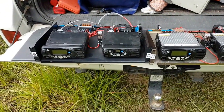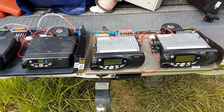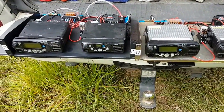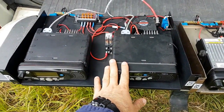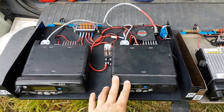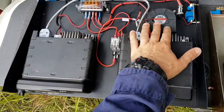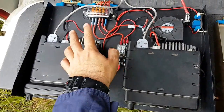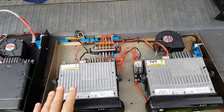We're just doing the upgrade here at Black Mountain. This is my homebrew VHF UHF repeater — a 2 meter 70 centimeter repeater. This one is multi-mode 2 meters, so it's going to do P25, DMR, and D-Star. It's got my standard Swinton chassis with the blower fan and the bus bar fuse holder, all from Jaycar.